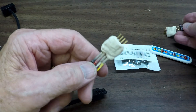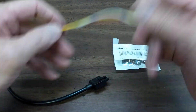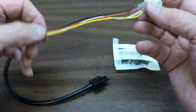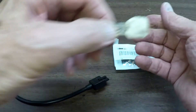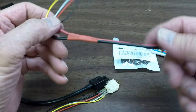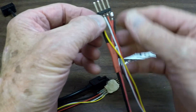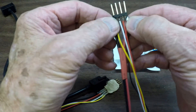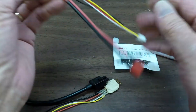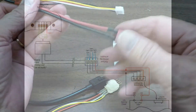If you're going to use it with a charger, besides putting these four wires on - this isn't set up for a charger yet, I just made it to see if it would work - you need to get a couple of fairly heavy wires and solder to the two outside wires, and then this goes to the heavy wires that come out of your balanced charger.